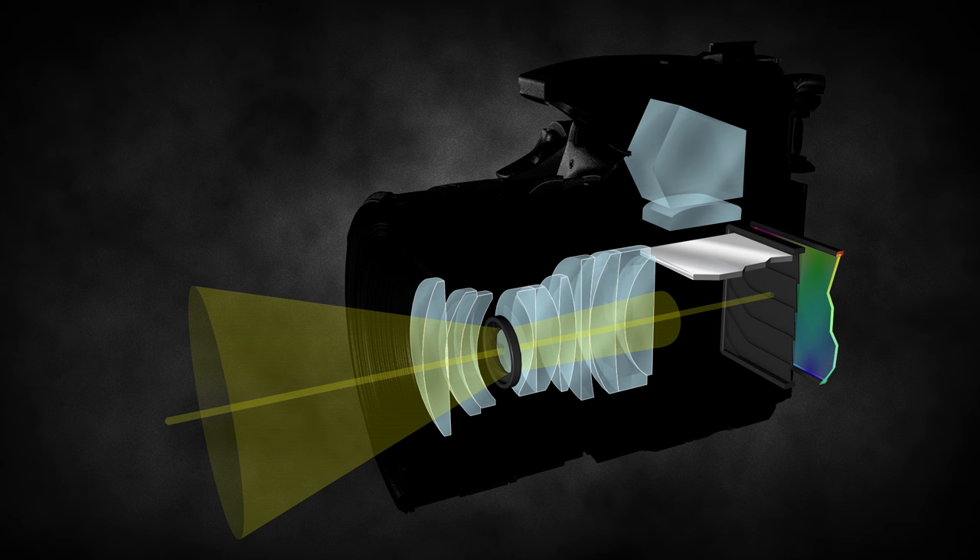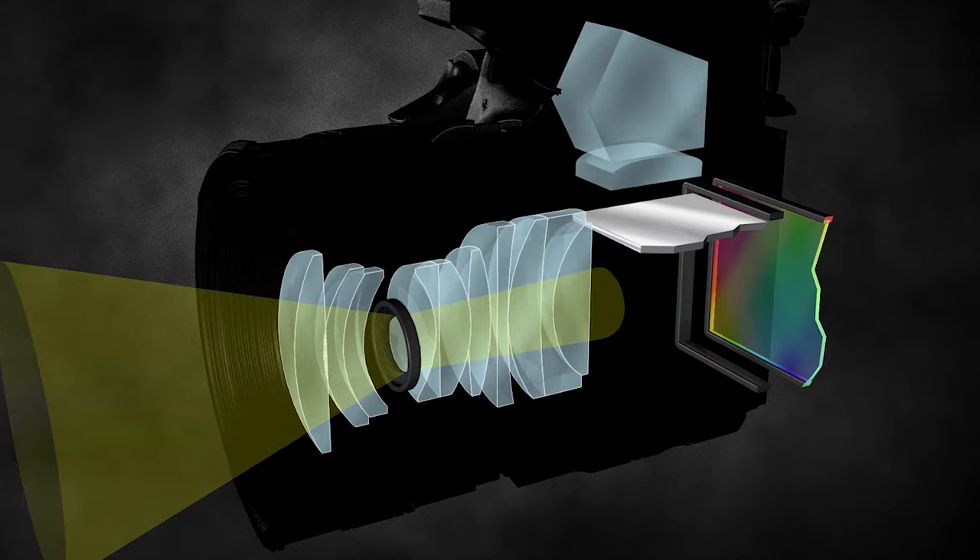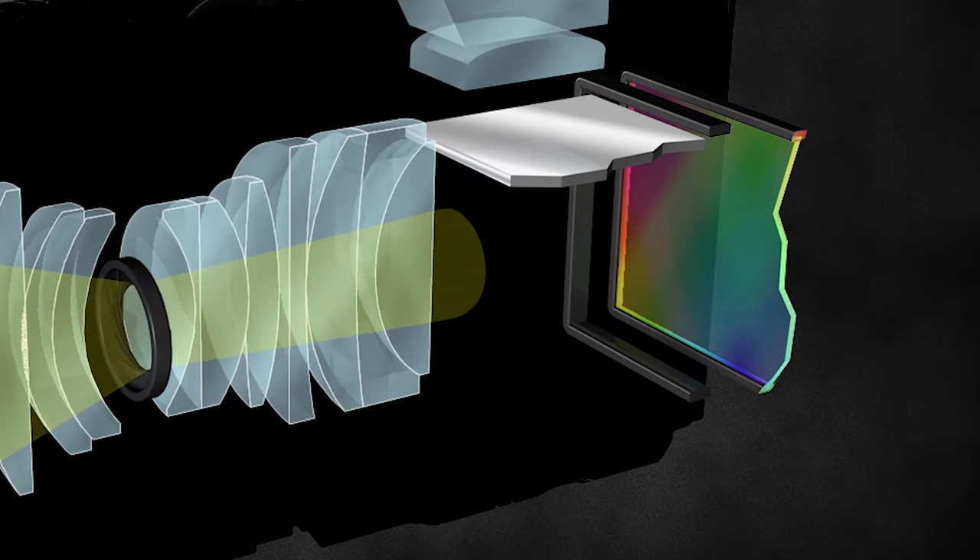The light then comes directly through the lens and hits what would be the sensor in the back. But there's a shutter in the way. The shutter has two separate leaves — one opens up revealing the sensor behind it, which begins the exposure and the camera starts to capture the image. Then one more leaf comes behind that, closing off the sensor so that it's not receiving any more light, and the exposure is then over. In the past, instead of a photo sensor, we would have had a piece of film that was sensitive to light. For this tutorial, we're using digital cameras, which have a CCD or CMOS chip with photo-sensitive material that allows it to track red, blue, and green colors over the course of many different photo sites. The camera then takes all of this information, breaks it down, and creates a file made up of millions of individual pixels, each its own separate color.